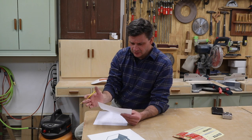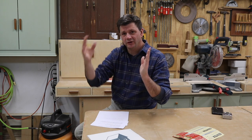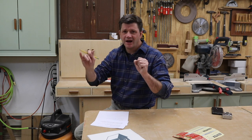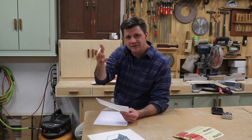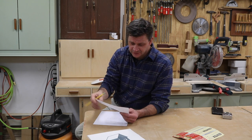A couple of questions about the hot glue — some people are skeptical about it actually adding strength. The hot glue I have has a lot of strength to it. When you're building something it's not just one joint; it's all the joints together. You've got the drawer screwed together, the glue joint at the groove in the front, tacked in the back, and then you run that bead of hot glue all the way around — it's like putting sheathing on a roof. That's something I learned at the woodworking shop I worked at years ago, and if you tuned into the interview with Bob, sure enough he had that bead of hot glue around the bottom of the drawer.